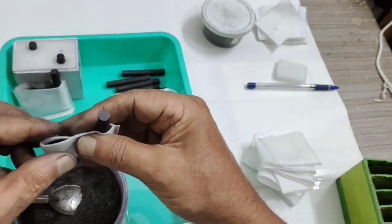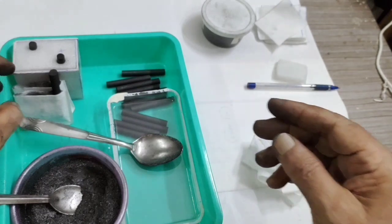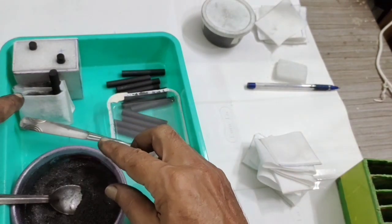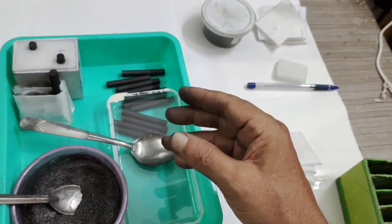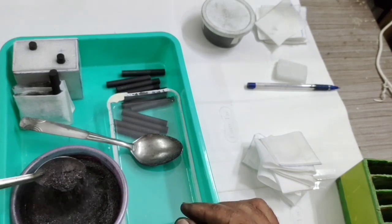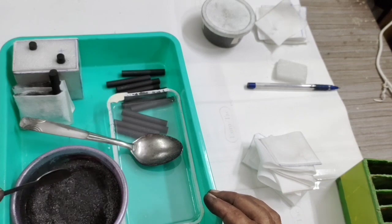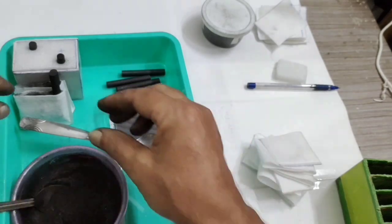So now I have filled this one. Similarly we make the other 4. I will make 6 numbers in total — these are called negative electrodes. For the positive electrodes, I have to similarly add, along with carbon, a little amount of manganese oxide and traces of lead and cobalt oxide. After adding, the same filling procedure applies.